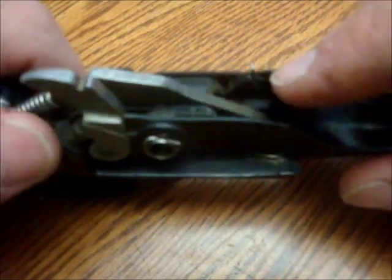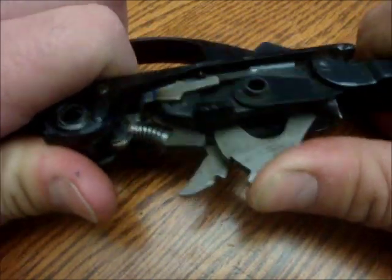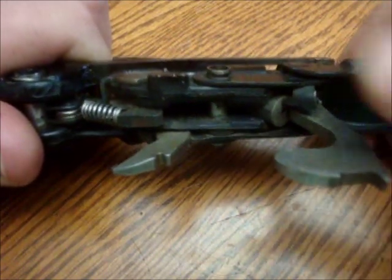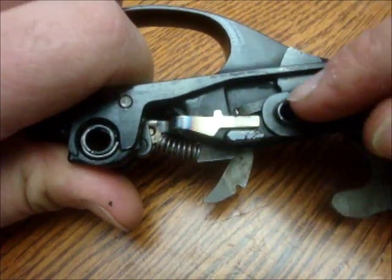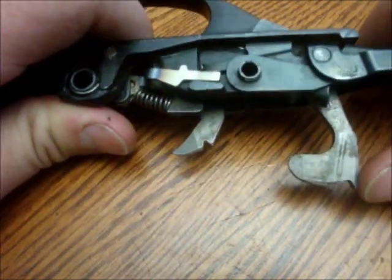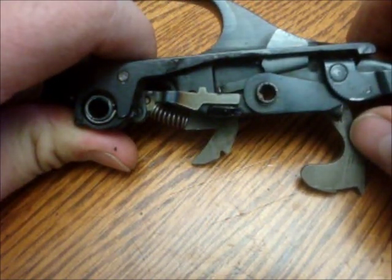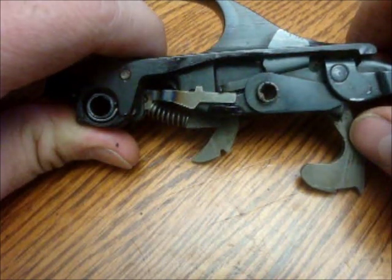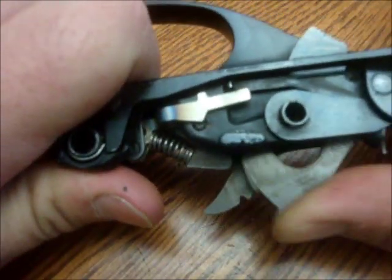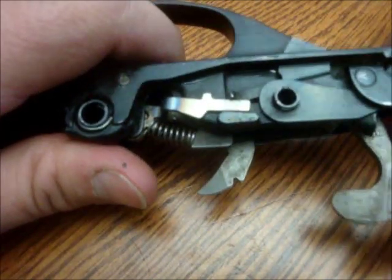You also have this here, which is connected to it as well. As soon as you fire it, the hammer comes up, and as the hammer comes up, the hammer spring pushes up on this thing, which then also pushes up on the disconnect and prevents you from firing it. So that's where it disconnects after you pull the trigger. If not, it would try to fire each time the bolt was moved past the hammer, which would cause a big problem.